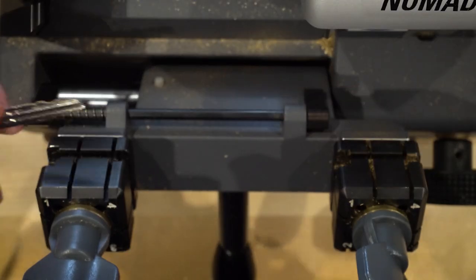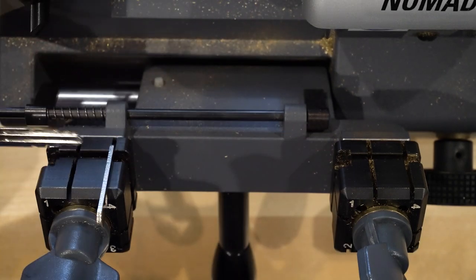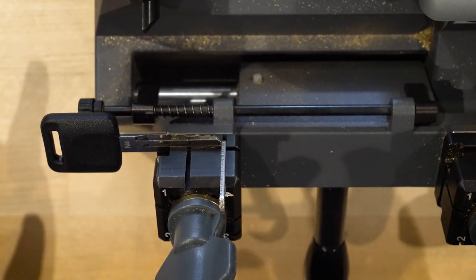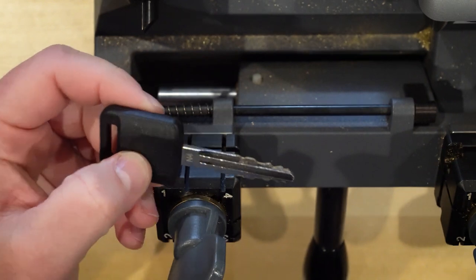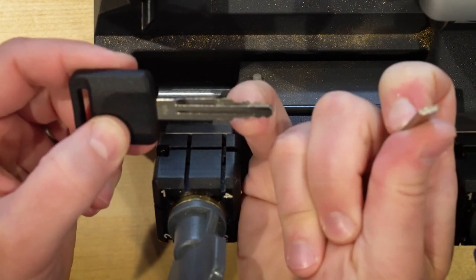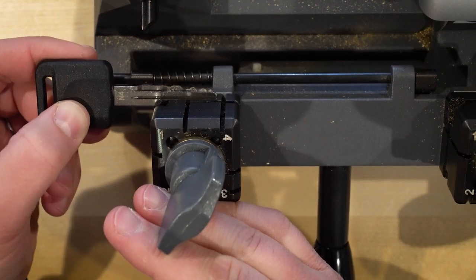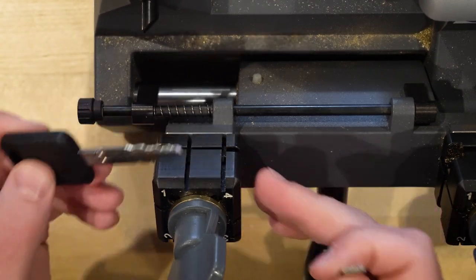I'm going to get the spacer in here in the furthest position. This key does not have a shoulder stop alignment, so it's going to be a tip stop alignment — typically you'd put the key in just like this. But I actually do not like to do it this way, and here's why: when we look at how much material meets on the jaw where these cuts are, that's what we're gripping on the back of the key. When you put it on the machine jaw like this, you can see there's not a lot of material for the jaw to grip on, which can cause you problems.